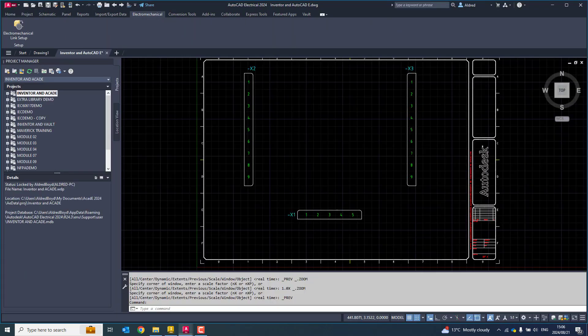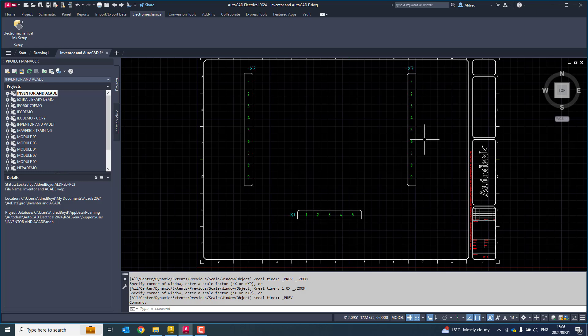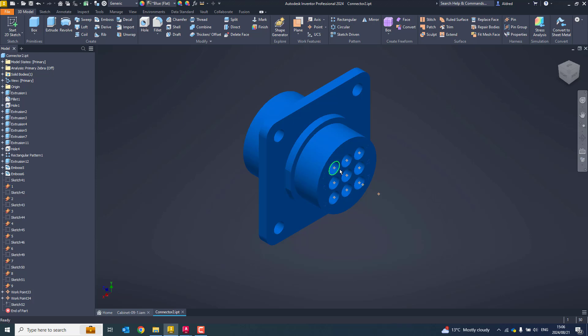So if I had to name these 10, 11, 12, 13, then I would also have to go and rename these pin numbers to 10, 11, 12, 13, 14, etc., so that the two could talk to each other — because when it does do the wiring, it looks for the exact pin number.